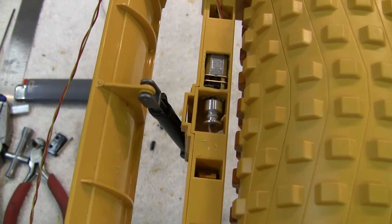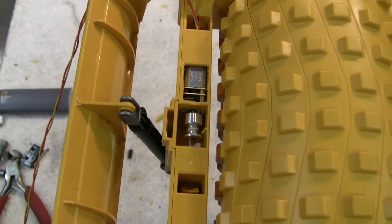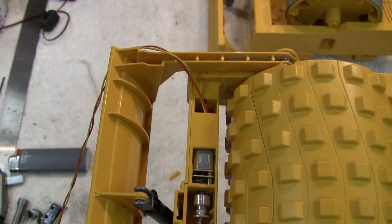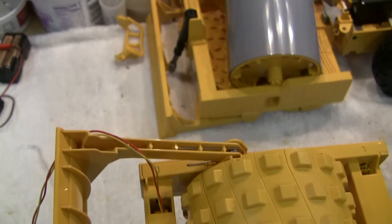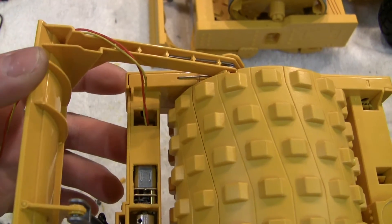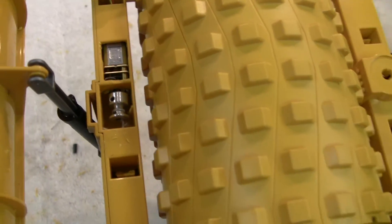The springs pull it down and the spring line on the drum sucks it back up — pretty basic. If you go too far in the downward motion it eventually wraps up and goes the other way, which isn't too bad. I'm thinking about whether to add a limit switch on one side — likely on this side where the wiring goes — to shut it off when it tops out. Otherwise I'll need to stay on top of it, because if I stall the motor it'll burn out or bust the gear train.